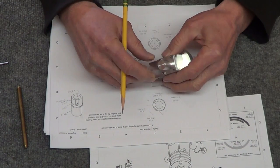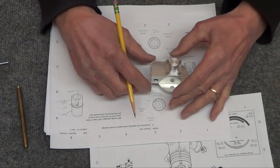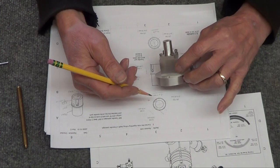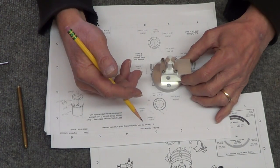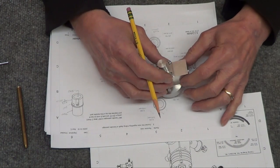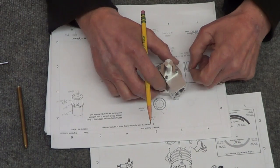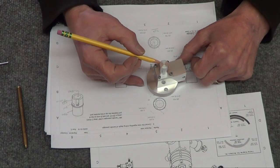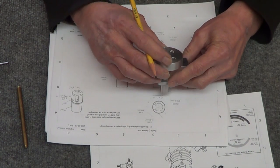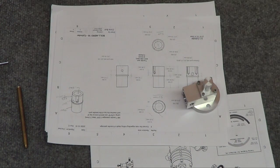That's pretty inexpensive. Look at that, man. That's a nice alignment. 380 thousandths off center. And I'll probably chamfer just the two bottom edges, make it look a little bit better. I really wish I would have modeled this thing first to actually see how everything was going to line up, because I would have changed, like I said before, a lot of these dimensions here to make it look better. Yeah, because look at where these screws are. They could have been way the heck in here. And like I said, this should have been the back support for the shaft. But all right, let me find some material, because this is the next part that needs to be built.